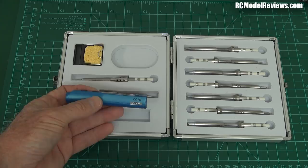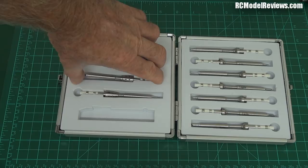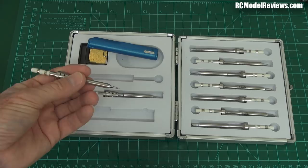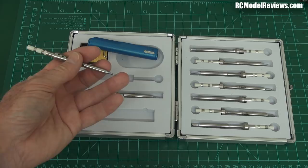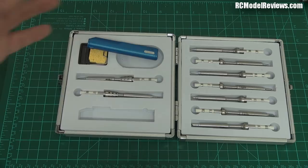You can do some clever stuff with this that your average $9 soldering iron just isn't going to do. Now, like most soldering irons there is a choice of tips, but this comes with nine. Some of them I would never use — this is a pointed tip, a conical tip. These are not much use because they don't transfer heat well. You might think you can work on fine pieces, but the heat doesn't transfer. Not impressed with that tip, but the rest of them are brilliant.